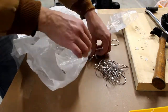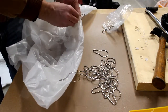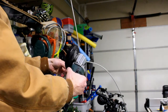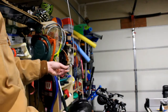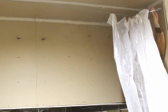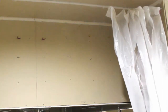I used some inexpensive metal shower curtain hooks, which worked well and were easy to install. Next, I'm going to trim the excess cable so the curtain doesn't get hung up on it. I'm using my angle grinder to take care of it quickly — just make sure you don't damage the other side of the cable that you need. A hacksaw or other metal cutting tools would work also. The next step is to thread the cable through the shower curtain hooks and reattach the cable to the eye screw. After it's connected to the turnbuckle, tighten the center section of the turnbuckle to take up the slack in the cable.